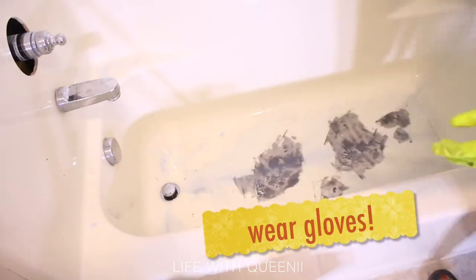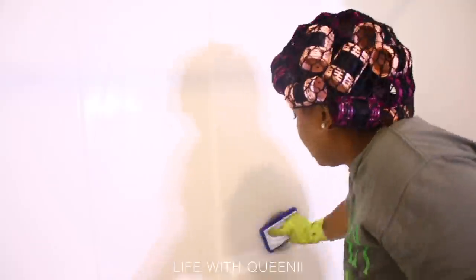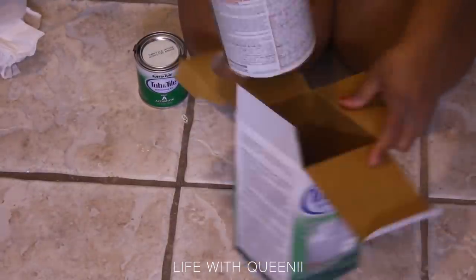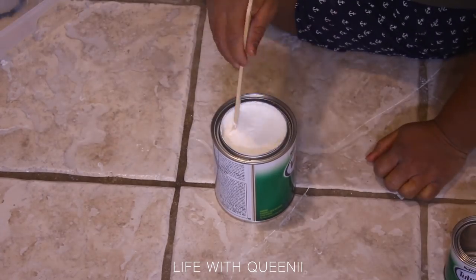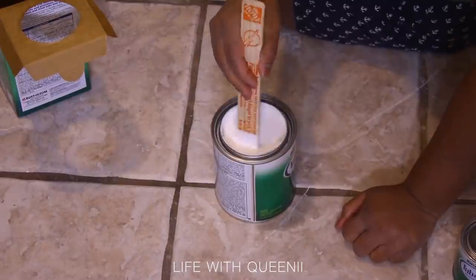I sanded it dry, then went in with water and sanded it wet. Then I went back in with the toilet cleaner — this is where I messed up by using it while the chrome was on, which tarnished the new drain. On my scrubber I had round sandpaper attached, which did double duty cleaning and sanding the tub surround as I prepped it for refinishing. Before you mix your tub kit, make sure the tub shower surround is completely dry and free of dust. Get yourself some tack cloth and a vacuum to get all the dust off.